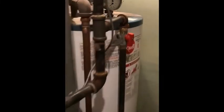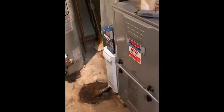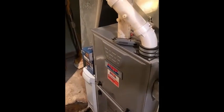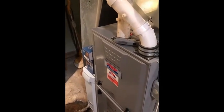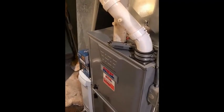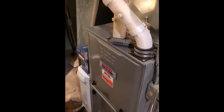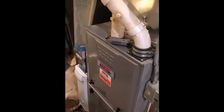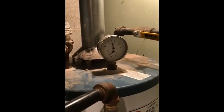Keep in mind: if you didn't have a cover on that filter slot on your furnace, you'd also want to run the furnace — fan on if your thermostat has that setting, or call for heat to get the air handler running. That would bring air in through the filter slot and could further impact your water heater's ability to establish draft. That's what we've demonstrated today.